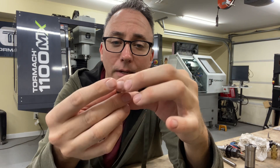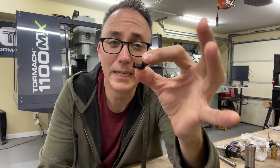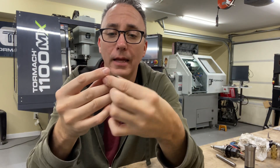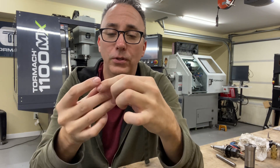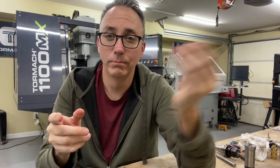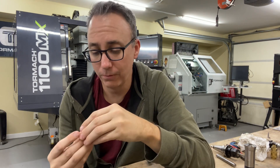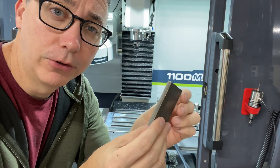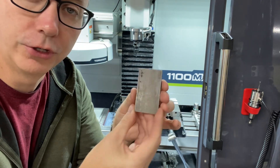So let's talk about what it is I'm actually making. This is the button that is used to release the bayonet from the rifle. It's a World War II Mauser I believe — you put the bayonet on the end of the rifle, this clicks on, and then when you want to release it you just press the button and it pushes this out so you can pull your bayonet off the rifle. The threaded part is broken, so that's why I have to make a new one. A little bit of World War II history right there. I'm going to make this out of regular steel — it's all I have on hand right now but it should do the trick.